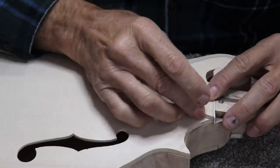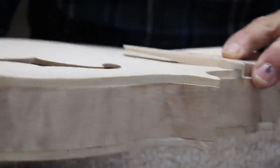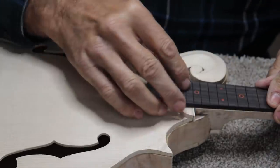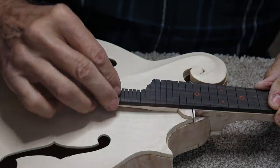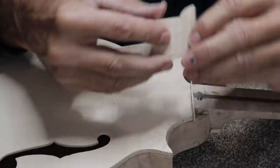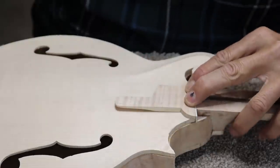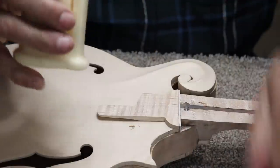See you later. Well, my friends, the part I'm making at the moment is the fretboard extension. And I've got it made. You can see there how it sticks up off the top, and the fretboard basically sits on top of that, and that steadies up the end of this once you get it all glued together. So it's all made and formed, and I have spent way too much time making this as perfect as I can get it. It's time to get it glued in place, so that's what I'm going to do.